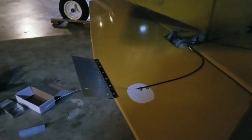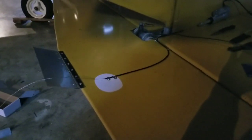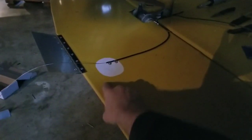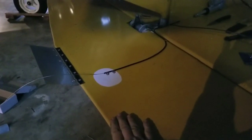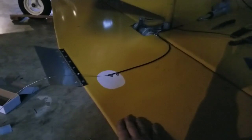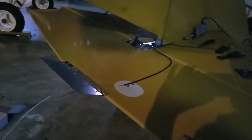After talking to Matt, he remembered some information and we realized that this plane could potentially suffer from something called flutter by putting that much weight out on the end of the elevator. It's kind of a really bad thing — basically, especially at higher speeds, with the weight out there you get this up and down oscillating action.